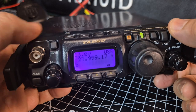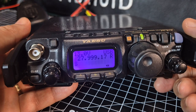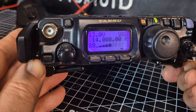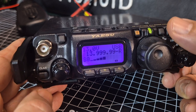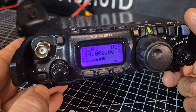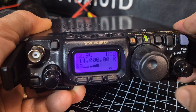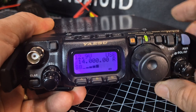Within all bands and modes you can select AM, FM, upper sideband — you can do two-meter SSB no problem at all. In the HF bands, hit the clarifier button here and you can fine-tune the frequency; press it again and it returns, but remember where you left it. For squelch: in HF I would use the RF gain setting, and in AM/FM I would use the squelch. Let's do some airband.